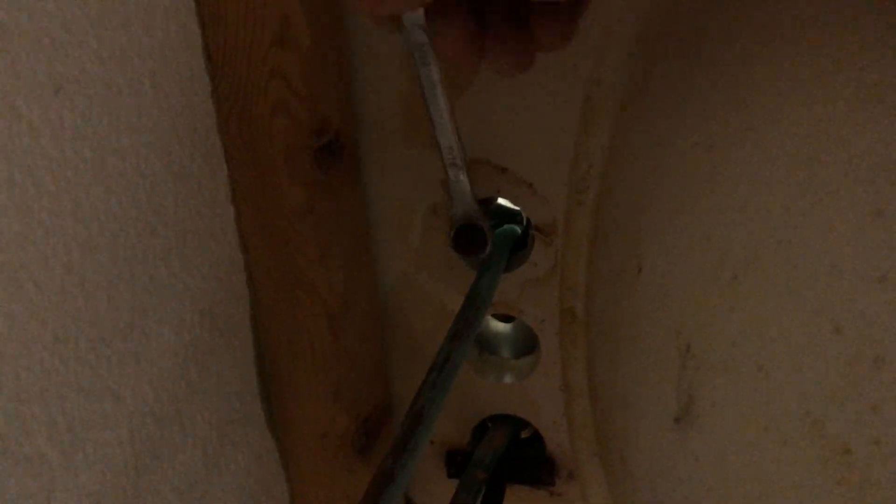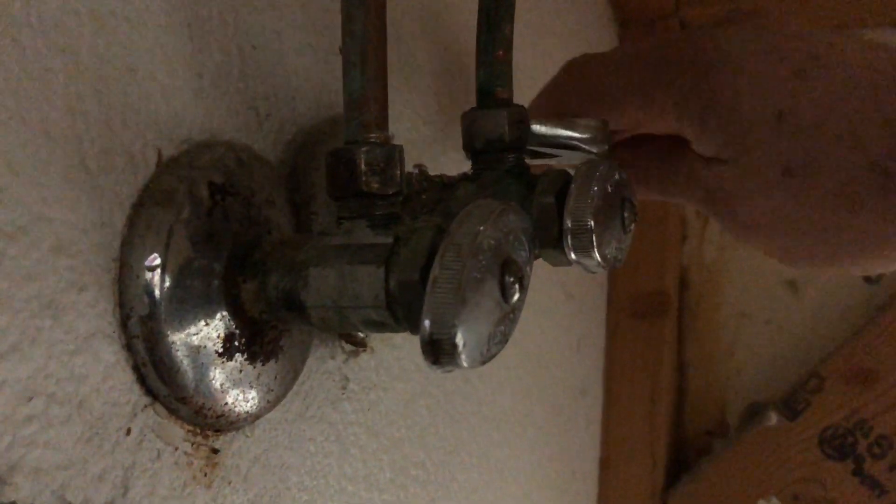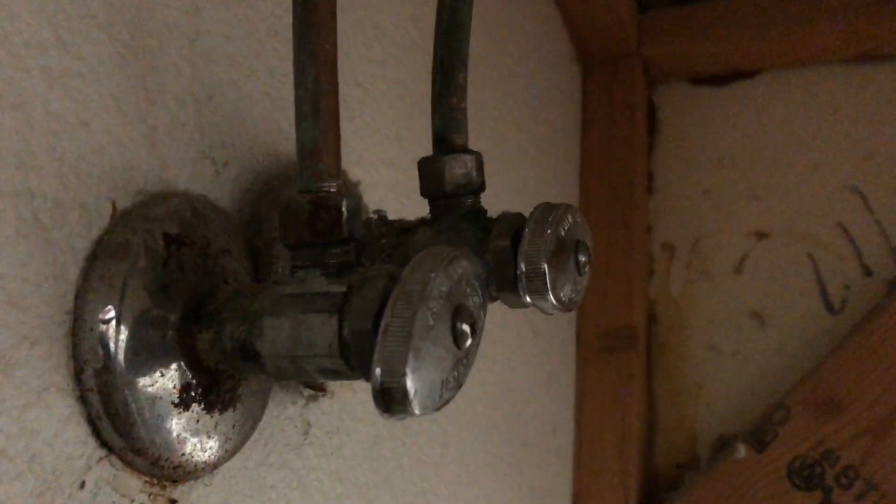There are two nuts right here. If your faucet has three holes it's gonna have two of them, and the pipes come in the middle. We're gonna loosen both of these. I already loosened this one to get it done faster — there you go, that's out. The other one is out too. Now we're going to open this one — you're gonna need this kind of wrench. That's the easy part. Loosen this part and once it's loose you're gonna pull it up.